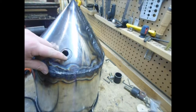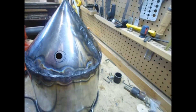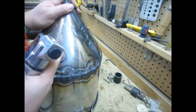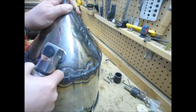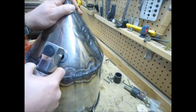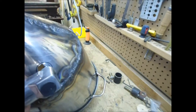We've already marked the interior dimension of that 1½ inch triclamp with — there goes the air compressor. So what we're going to do now is use our air nibbler to eat out the material inside of this sharpie-markered set. You can see what you get — basically it nibbles out a semi-circular shape. I'll take a whole line and show you what we get.